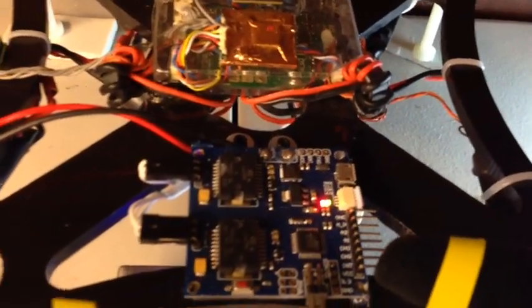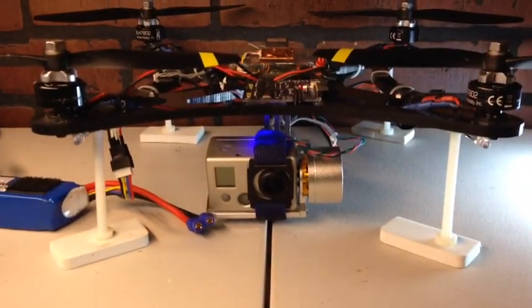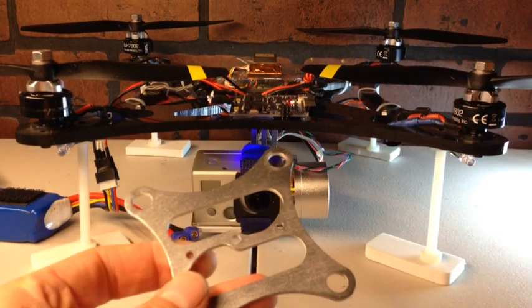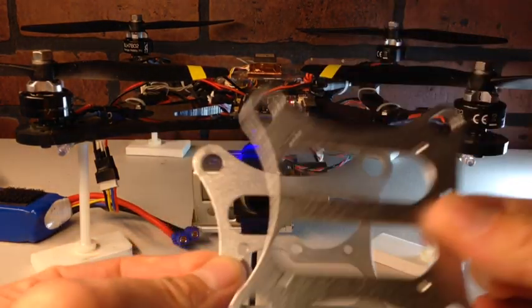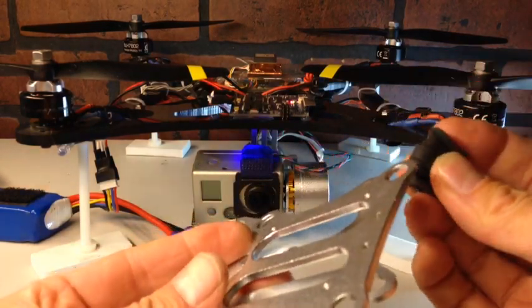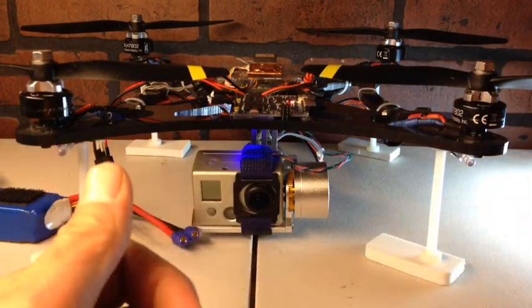This is actually my board for my gimbal right now. I had a couple of pre-flights and I didn't like the amount of jello that was happening with the flight, so I actually removed the entire frame — the upper and lower frame with the anti-jello mounts. I call them the pro-jello mounts because they seem to promote jello.